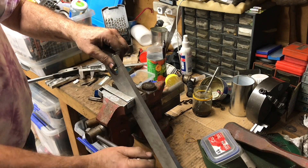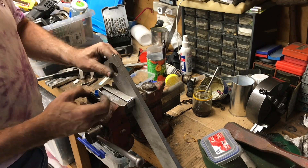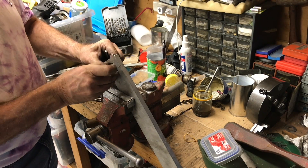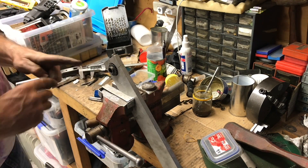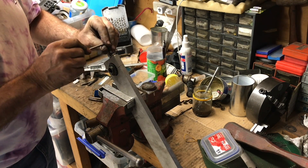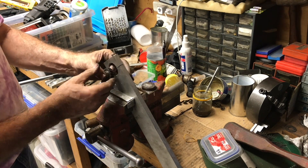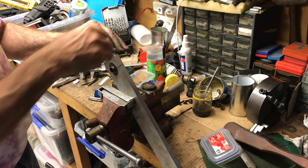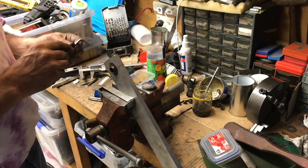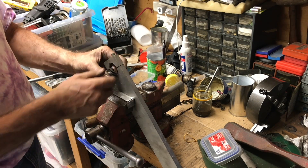The stud gear is actually a compound gear with two gear wheels connected by a keyway. The gear closest to the casting has to have the same number of teeth as the spindle gear. Since I've removed that gear anyway, I've got it available for testing the diameter of the hole. The reason these two gears must have the same number of teeth is that it's designed so the stud turns at the same speed as the spindle.